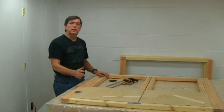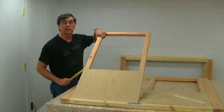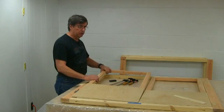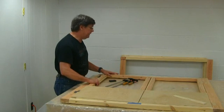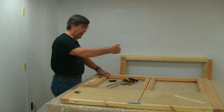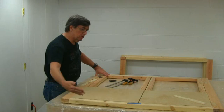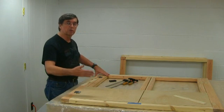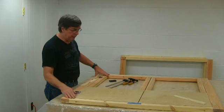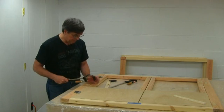Now that I've got the enclosure taken apart and on the work table, I've inserted the doors. This is one of the front doors — I've got both doors in the framework for the front frame. I've sanded all these parts down with an orbital sander and slid this back in place. What I'm going to do is clamp the door to the outer edge so that there's a gap in the middle so the doors swing and don't interfere with one another.